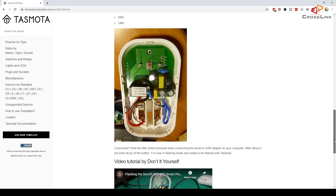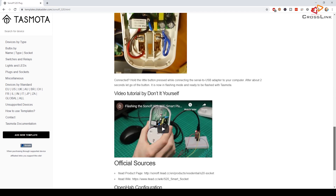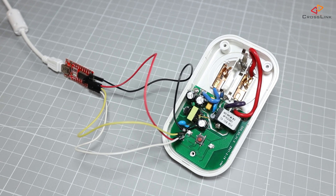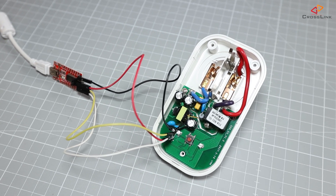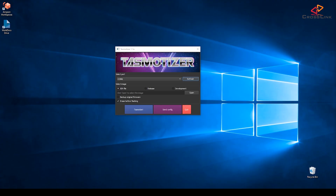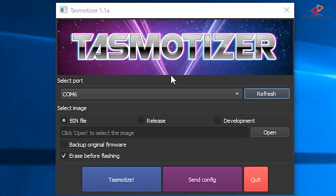This is now how it should look like, so we are ready to flash some firmware. I'm going to use a free software called Tasmotizer, which I've linked in the description — available for Mac or PC. This software makes it super easy to flash firmware with literally one button click. Once you have that ready and running on your computer, look at the list of available COM ports.